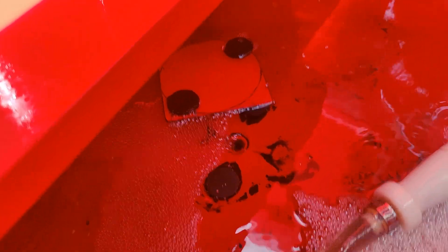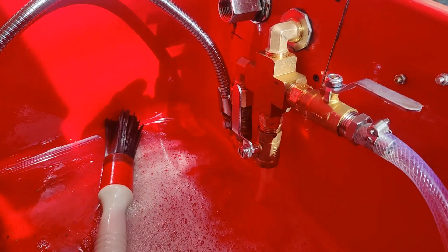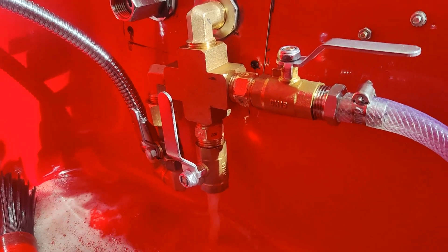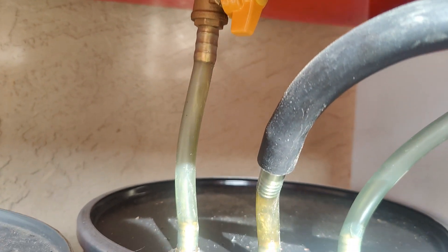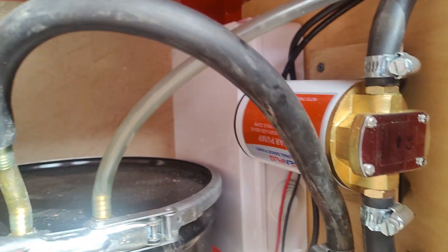Back up at the top — I made this plate and attached it with magnets. It's an anti-vortex plate because I was getting a lot of vortex whirlpool effects at the plug, especially with the breather vent closed. This plate keeps the system from sucking air into the bottom and allows the pump to run at higher flow rates without creating bubbles in the solvent. The solvent tank is currently running at about half capacity — there's almost nothing in the top, and that's one of the big benefits of this whole system. I also have about a gallon of water in the system to help separate dirt from the solvent. The solvent is stored in the lower tank where it can be sealed off whenever I'm not using it, preventing evaporation and extending the life of the solvent.